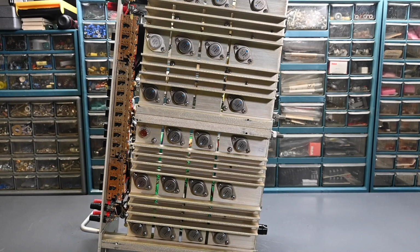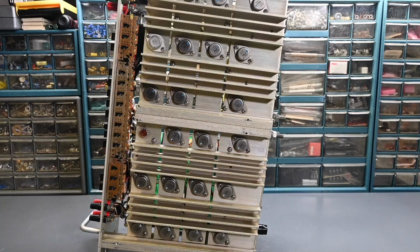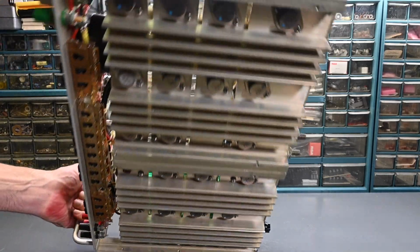And I won't go so high as to cause further damage. I don't want to damage any resistors, current shunt, something like that. But I'll use one of my variable voltage power supplies, and let's maybe say 10 amps or something like that. Let that run through there and see if a transistor heats up, or if the SCR is shorted, maybe it'll start to warm up, something like that. So let me grab some test leads here.